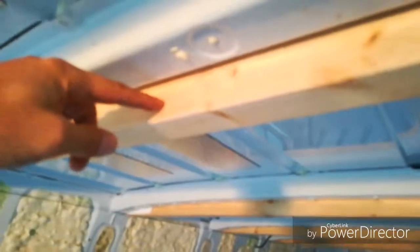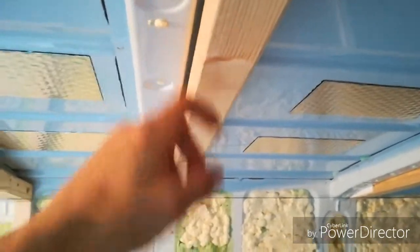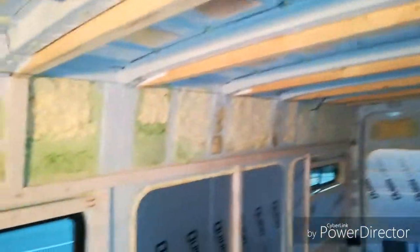I'm losing the light, but I'm just going to put that one in like I showed you and go through and put all the uprights in. Because we've got the 2x2 here — I know we've lost about 25-30mm — but now there's a nice wide fixing and a solid fixing. It's just like a ceiling in a house.